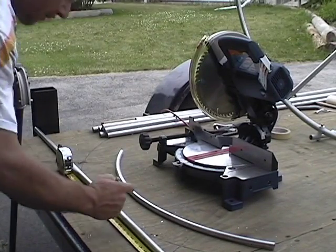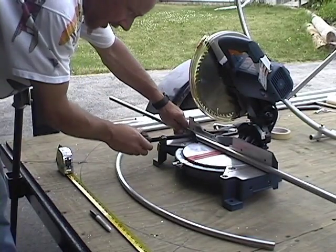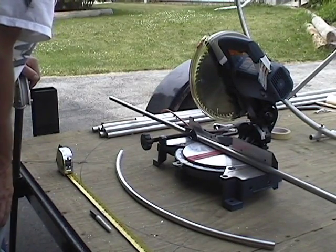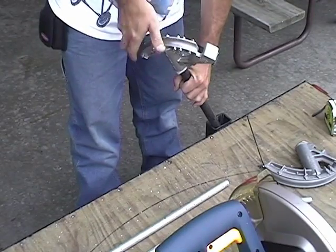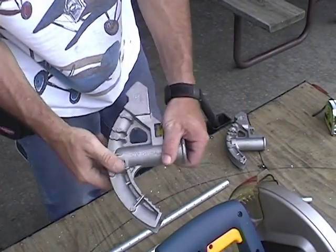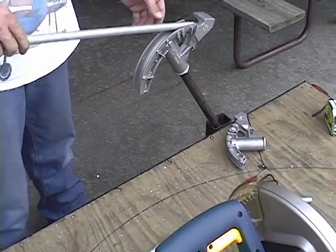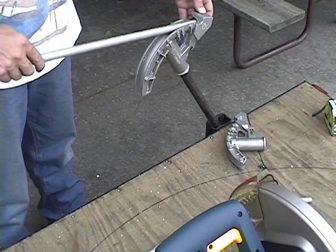We're going to take our 6'2" 750 and cut it in half — three feet. For this we just use a cheapy cutoff saw with a fine-tooth finishing carbide blade. For the 750 and the 875 sections of the cage we use another Gerber Bender. This one is three-quarter thin wall and one-half rigid, Gerber Bender number 931. It's just the same procedure — line up your one-inch marks with the edge of this part of the bender and just start bending.